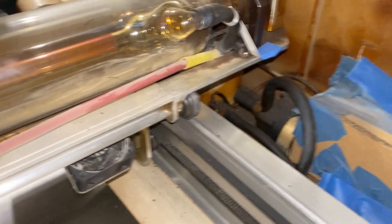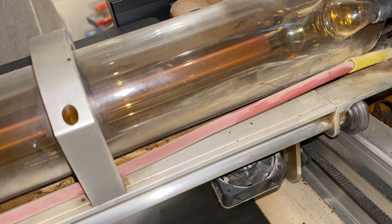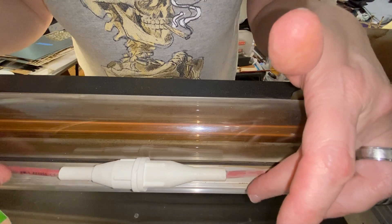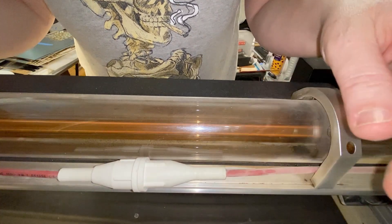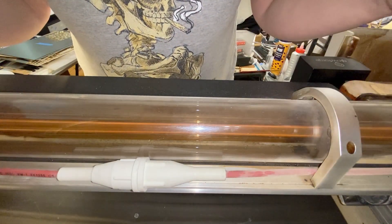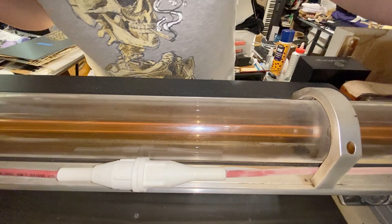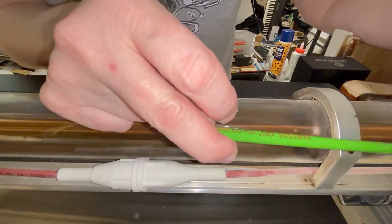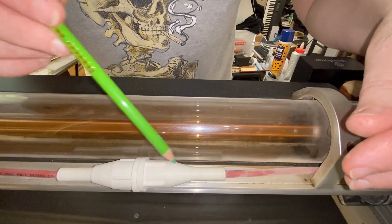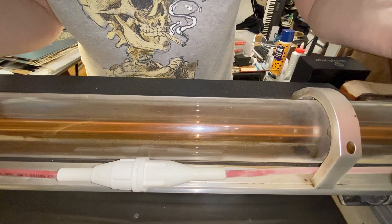We use the aluminum hoop for cable management. We did not use the black silicone sleeves because they're not sized for the Glowforge wire — the Glowforge wire is a wee bit thicker than what this kit is designed for, so you will have to make the openings larger. As you reassemble your wire, assuming that your split is in the middle like ours was, you will want to run the wire through over here, through the metal hoop. Make sure that you put the smaller end to the outside before you start to tin your wire and connect things, otherwise you're going to have to take it apart and put it back together again.